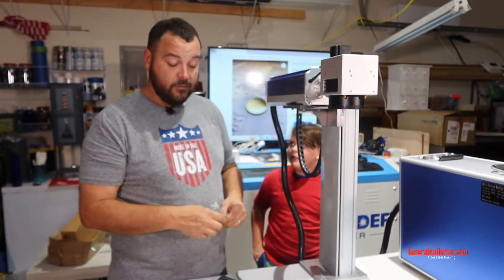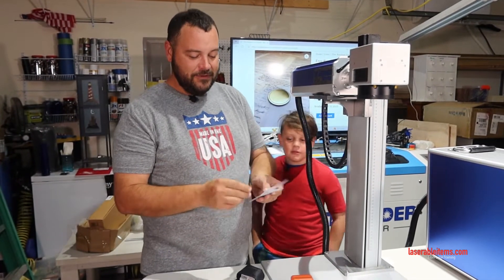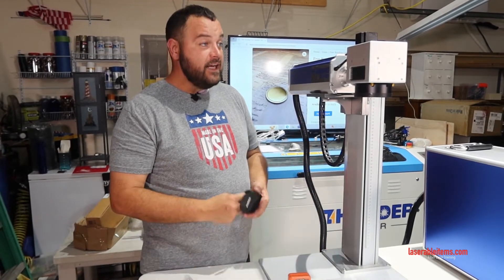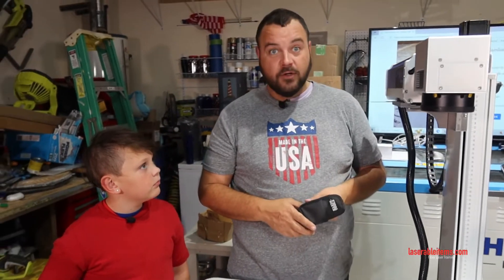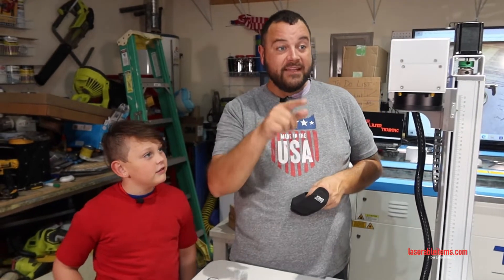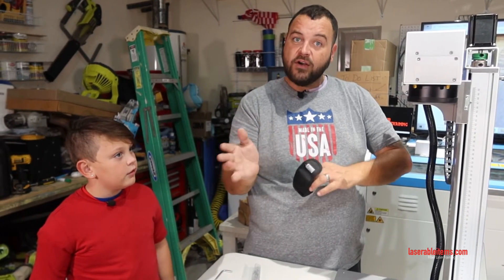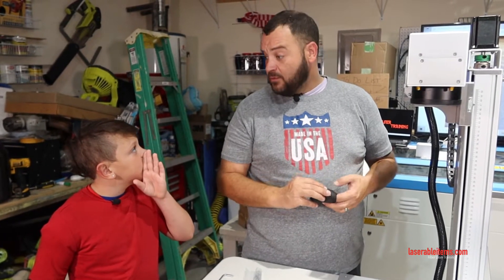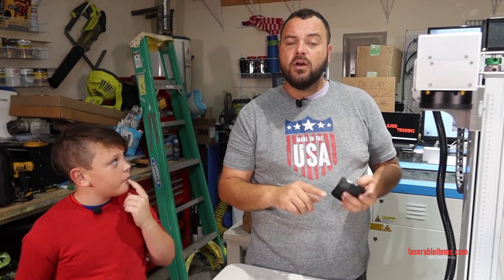You can use anything you have for shims — brass shim stock or whatever. In any event, our next video I think we're going to try to hook this bad boy up to a computer and see what we've got, so we can square it. Now that we are nice and level, we need to square it to our base. If you guys want to do this with us, get yourself some tape, a permanent marker, and a speed square or framing square of some kind, or just a nice straight edge.